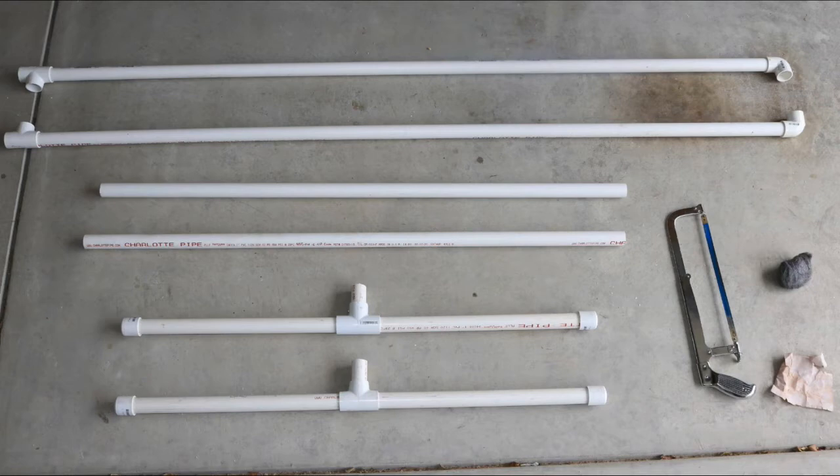Repeat for the other 2-inch piece. The two 20-inch alignment pipes we're cutting — one end of those will be ground down so that it will press into these two fittings while aligning the gluing of those fittings. These two have to be aligned very carefully so that they'll be pointing parallel to each other, so that the top and bottom supports will fit straight across between the two side supports. Do not use a ground end of a pipe later in a glued joint — it will fit too loosely.